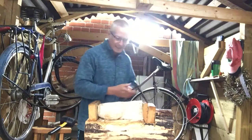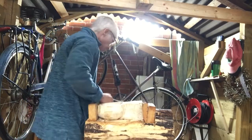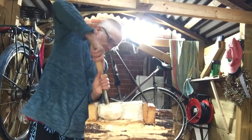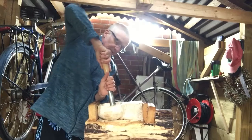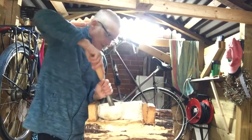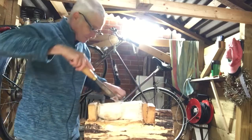So once we've taken out about 4 or 5 centimetres, we can start to roughly carve out the inner shape of the bowl. Now for that we stop hammering the poor chisel and we start to do some pushing, just pushing. This is where you need a very sharp chisel. So basically I'm just pushing down all around and we're gouging into the wall so we then match the inner wall with the outer, hashed out outer wall that we've done with the axe.